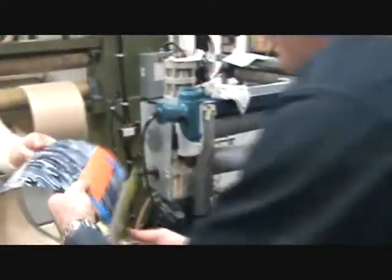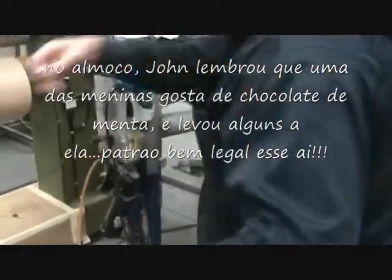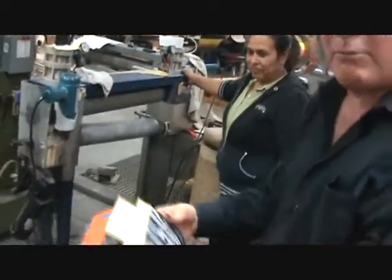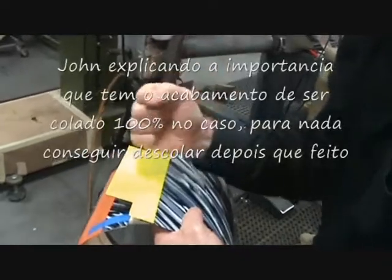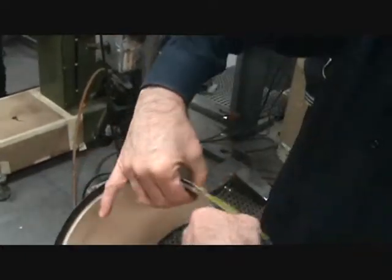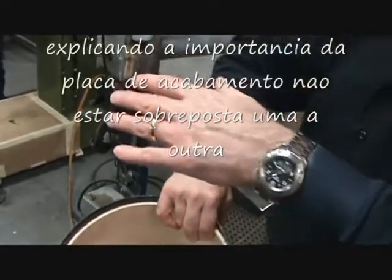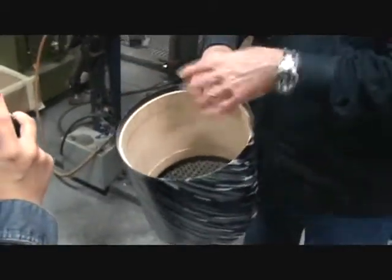All right, first of all, the way we do a finished ply, the way she's going to do this, oh, Hannah. Is if you wrap this finish around, it wants to be adhered to itself. If you don't do that, it'll lift up and come apart, all these problems. But if you bring it all the way around, you have two surfaces here and only one surface here. If you take that all the way up to the drum head bearing edge, therefore, when you put the head on, it's off center, because it's thicker here and thinner there.